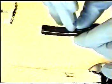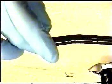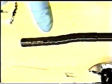We have now removed the 4 pieces of Scotch tape from our endoscope. Be careful not to get any epoxy on the bending rubber or insertion tube when removing Scotch tape.